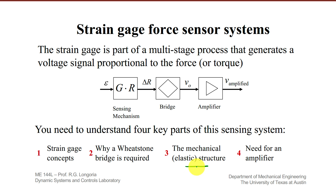In the previous video discussion on the strain gauge type force sensors, we described how the output from a full bridge strain gauge sensor — this change in voltage when you apply a load and induce strain on this full bridge type configuration — is still kind of small, in the millivolt range. There's an input voltage here. Sometimes these sensors are characterized in millivolts per volt, and that value is basically calculated by the gauge factor and the amount of strain that you have.